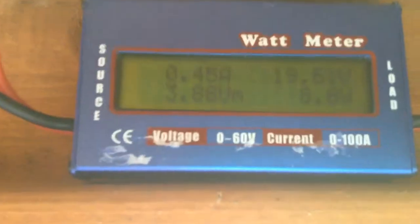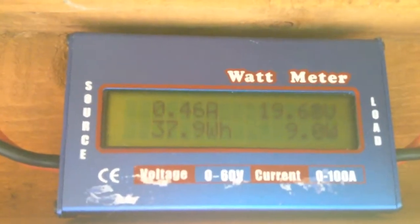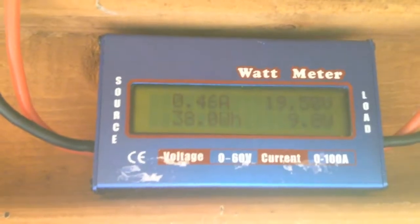Now I have been redoing my system. I had an accident I'll tell you about later, and I was using the soldering iron that you saw on the table out there connected to this battery, and I ran the battery down a little bit. So when I reconnected the solar panel, we had a peak charging current of 2.25 amps to bring the battery up. So that's one of these eBay watt meter things. There's a feed, the cable goes round and through the hole in the wall to the 50-watt panel that you saw outside.